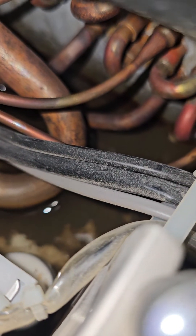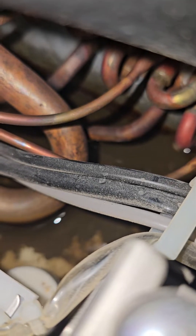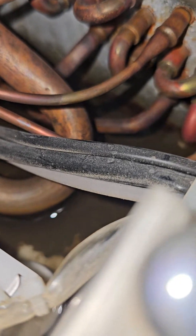You can see it's shaking in there — there's a lot of water. The float is right there, that white-brown plastic piece, it's a float. It's very high, it's floating — well in this case, in water. That's why we have this error code. You can reset it as many times as you want, it's going to come right back until you address the problem.